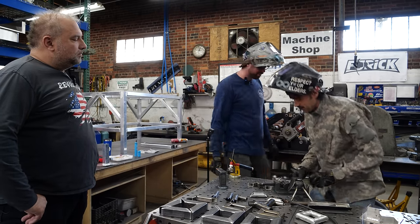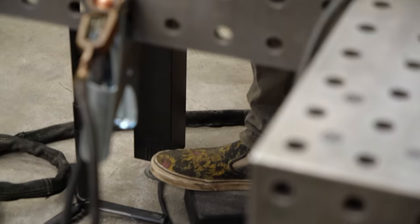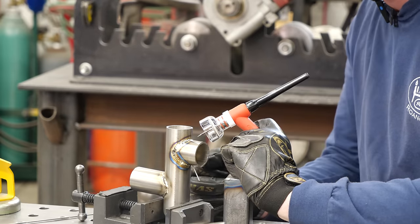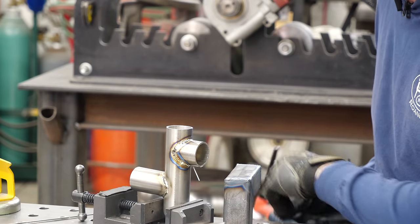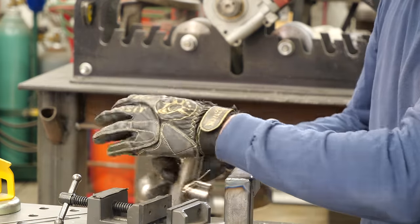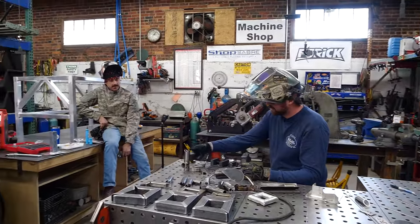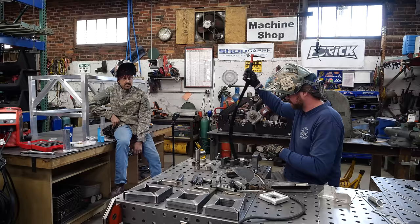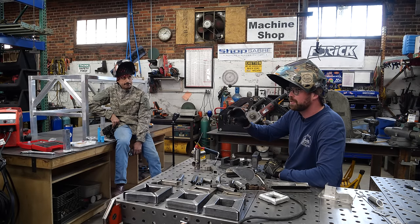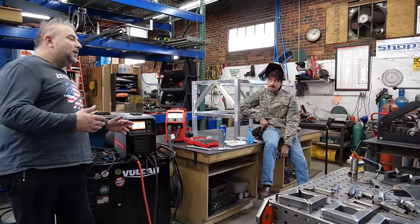Let me finish up that top joint with the special rod. Normally I wouldn't be able to see where the filler is, but I'm looking through the side of the cup right now — which is kind of why they started doing these kinds of cups. This is in some ways overkill because I've seen some people do it with like 14s and 16s, but some people are just that good. If you're not that good, these things can help you a lot.